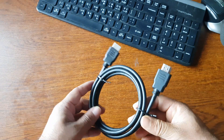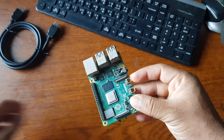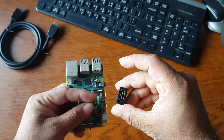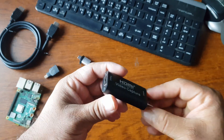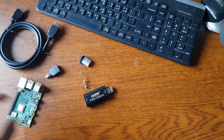To use your Android smartphone as a display for your Raspberry Pi, besides the Raspberry Pi and Android phone, you have to buy a couple of things. Number one is an HDMI cable to connect your mobile phone with the Raspberry Pi. If you are using a Raspberry Pi 4 board, you also need a micro HDMI to HDMI adapter or converter. We also need a USB Type-C OTG adapter for the Android smartphone, and one more thing: an HDMI to USB dongle. Using this dongle we can capture the video output from our Raspberry Pi and preview it on our Android phone.